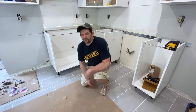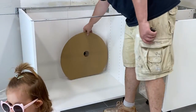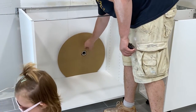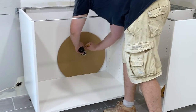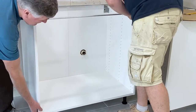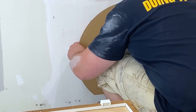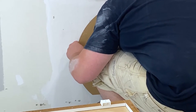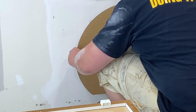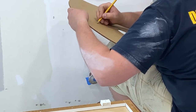For this step, we have a little trick up our sleeve to make this process super simple. We used a piece of cardboard with the factory edge on the bottom, drilled a hole to match the size of the drain hole, and made sure the holes matched up inside the cabinet. With the holes lined up, we marked the vertical axis on the cardboard to help with vertical alignment against the pipes later. We then threaded the cardboard onto the drain pipe until it pressed up against the other water pipes. Keeping the factory edge parallel to the floor and adding slight pressure, the pipes leave indentations of where the rest of the holes need to be drilled. I circled them by hand to make them more visible during drilling.